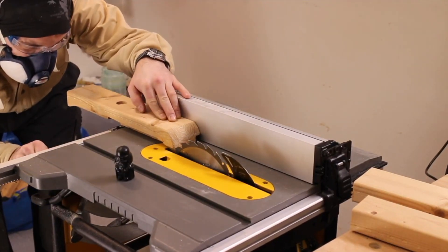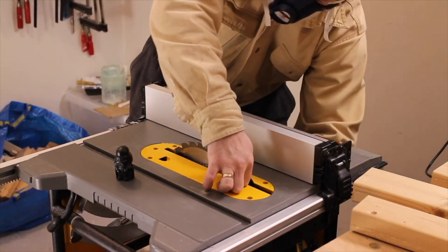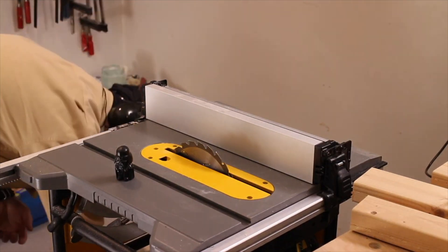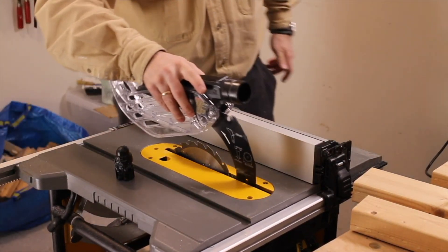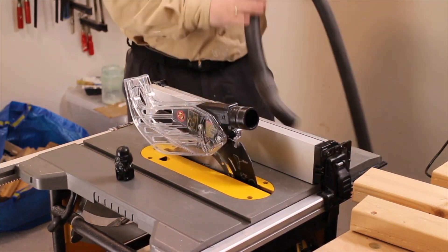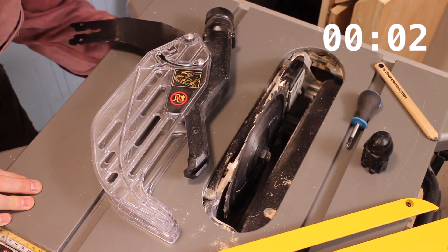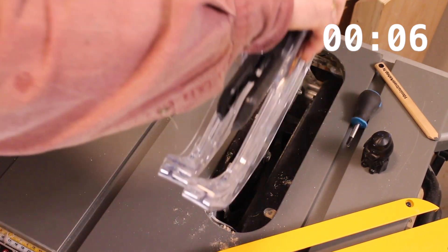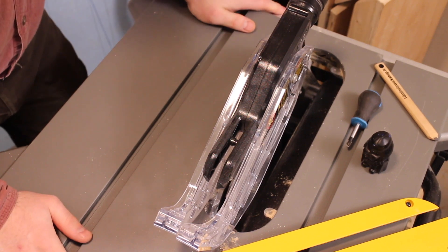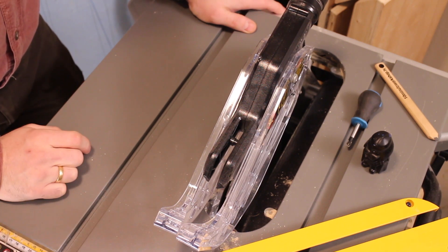By far my favorite feature of this saw is the quick-change riving knife, and in my honest opinion this is a better safety feature than any saw stop function — because it will make more people use the blade guard since changing between blade guard and riving knife is so quick. After having this feature on a table saw I would never have a saw without it. It could come with internet, whale skin hubcaps, baby seal lights for headlights and all other awful interior — I would still go for the quick-change riving knife. So you really have absolutely no excuse not to use the blade guard now.